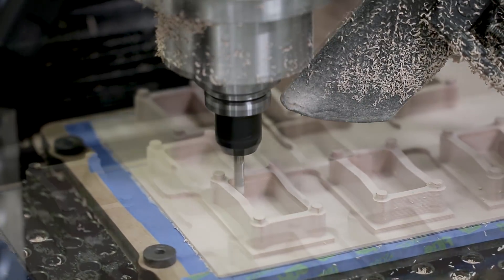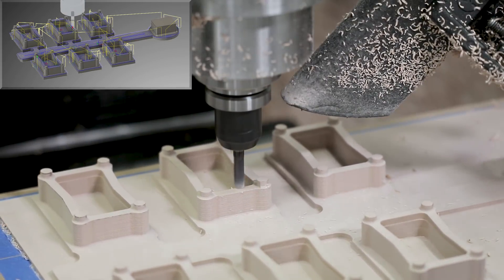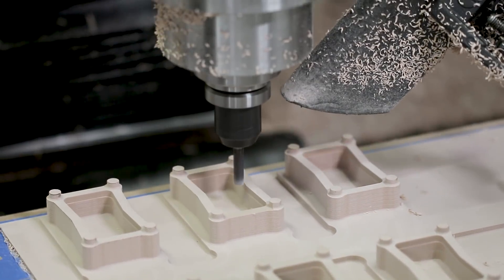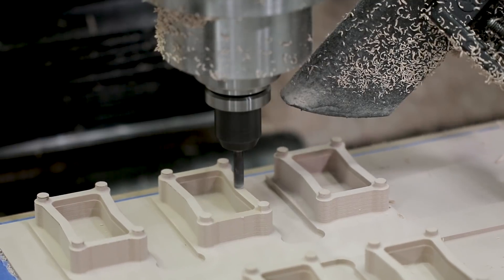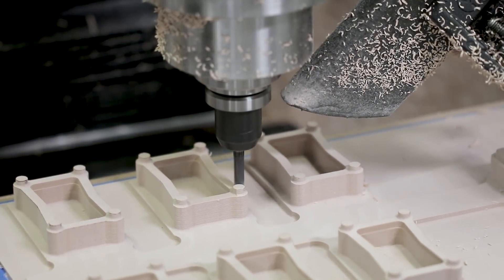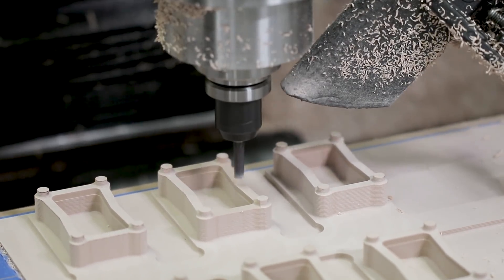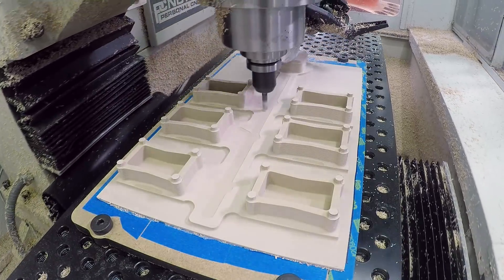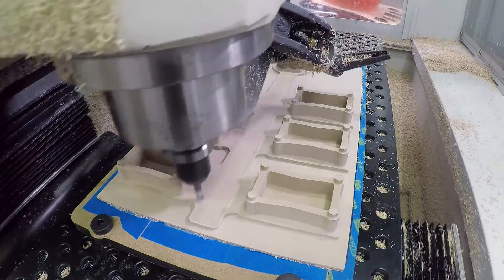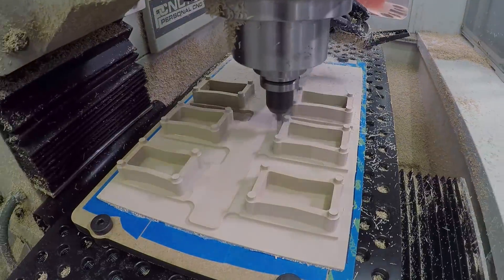Same thing with the horizontal — better safe than sorry, especially on a part like this where we've only got one piece of raw material and it's relatively expensive. But the adaptive with the Taz actually left a really good finish, so I don't know that it was worth the time. Also, remember the task at hand: it's a casting pattern. We had great floor finishes from the adaptive, and while the draft angle is really important, the RA or smoothness of the floor finishes here isn't going to have a huge impact on the quality of the casting.